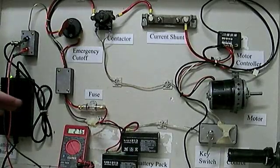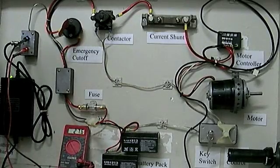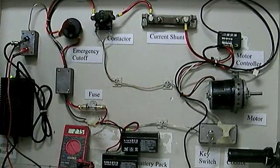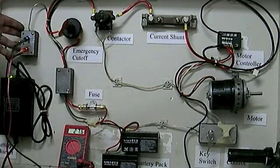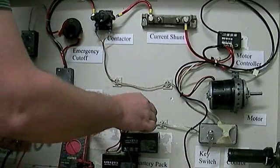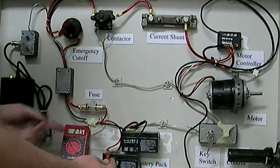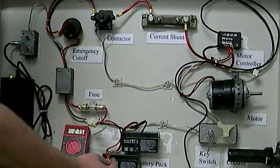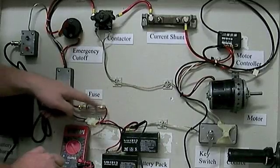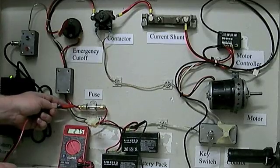Let's do a little walk-through. Right now the battery pack is running at 27.5 volts — we have it on a small charger because the batteries need to be replaced. We can trace this power through the system on the red wire. Coming into the fuse, it's a little hard to reach but we can get to the edge of it, and we still have 27.5 volts there.